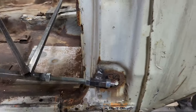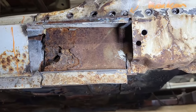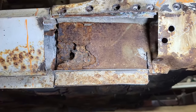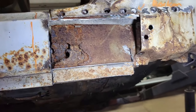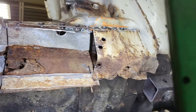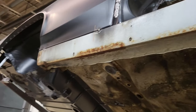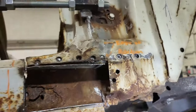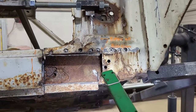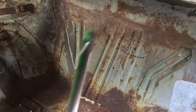Let me move the car and show you what's inside. Looking inside the kick panel, that is a pretty heavy brace — some pretty thick steel — and you can see it's completely rotted. This is a structural area, so it's a good thing we're cutting this apart. The top of the rocker doesn't look too bad, but as we go down we've got rust starting, and I'm pretty certain these areas on the inside are going to have pitting. Since we had to cut this all out up front, it just makes sense to replace the rocker.